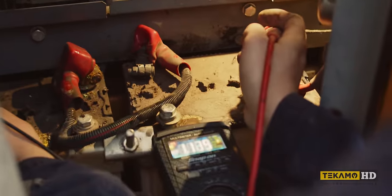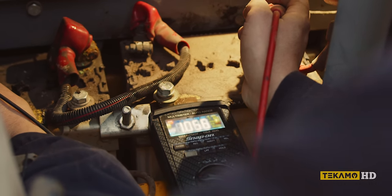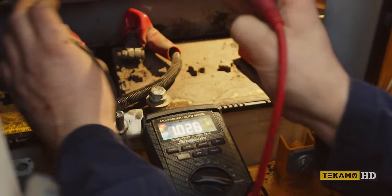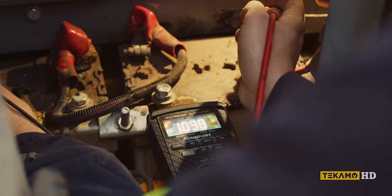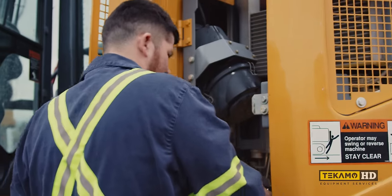We just found that one of the terminals is corroded. Look at that — check out my meter, how many volts is that? Between the battery negative on one side and the positive on the other, we should have 25 volts and we got one volt. Our voltage drop test confirms there's no voltage.